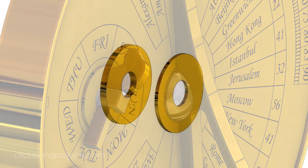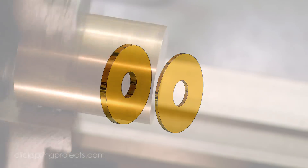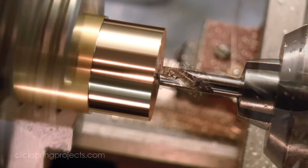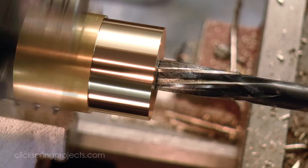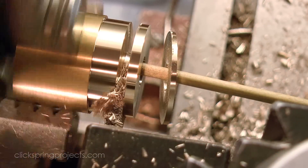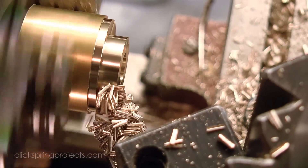The final components of the Gnomon and suspension arm assemblies are the spacers. These are a straightforward part to make, but they play a key role in keeping the tension of the suspension arm just right once it's pinned into position, as well as ensuring the correct clearance of the arm over the face of the lunar and solar displays.